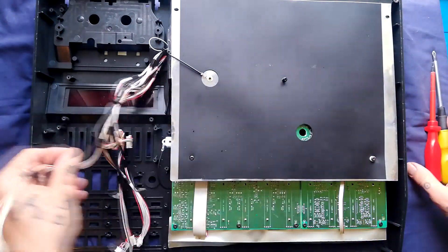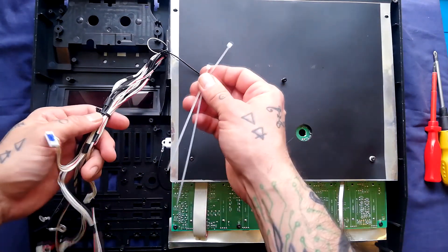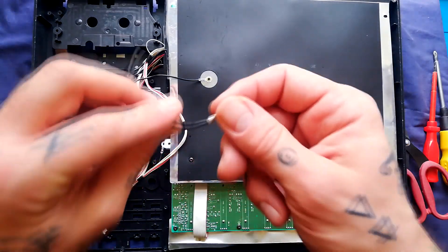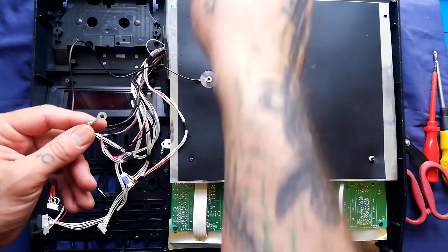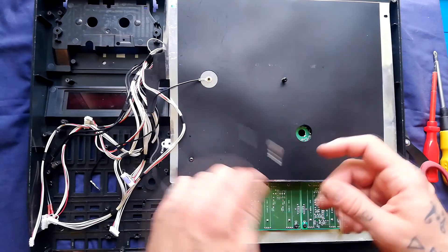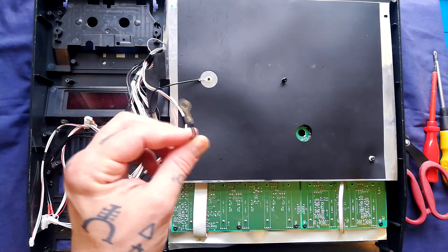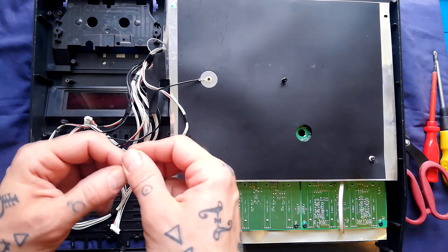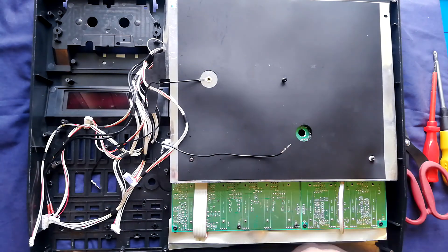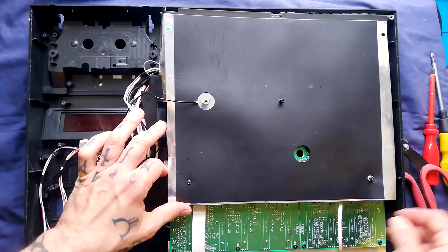There's some malleability in the plastic on these hinges — that little pin is going into a little hole in the strut sticking out of the case. Moving on to this side: all these cables are held together with two zip ties. I'm going to cut them to make it easier to see what's going where. You can see that this bit of shielding is going to one of the ring connectors on the metal plates from earlier — like a lot of these ring connectors were all converging on this metal plate to create a common ground. You can think of ground almost like grey water drainage in a house — all the buzz coming from the PSU needs to go down the drain, and if all the drains don't meet up you can end up with problems. That's probably a specious analogy but it'll give you a gist.